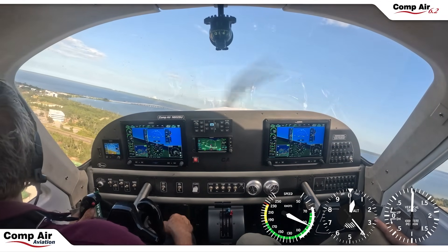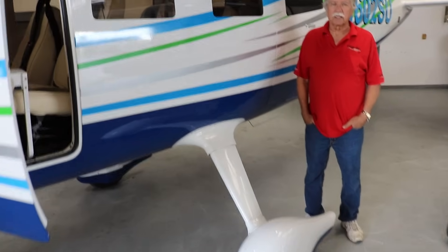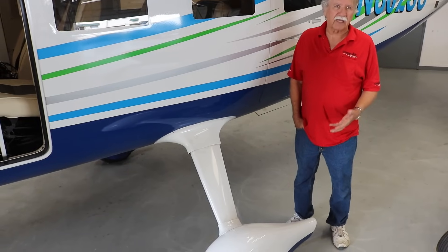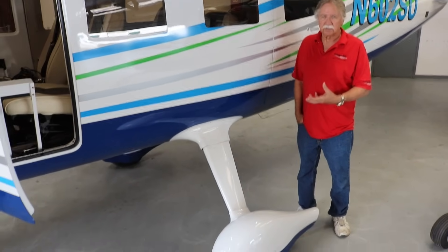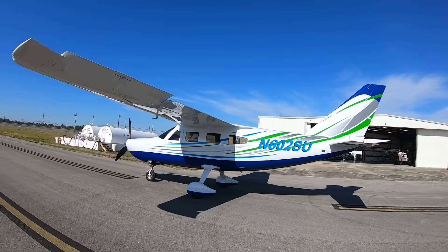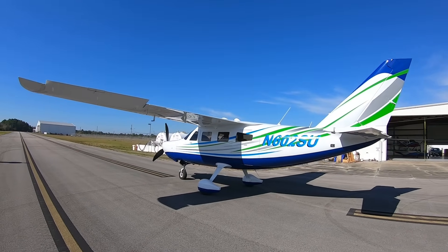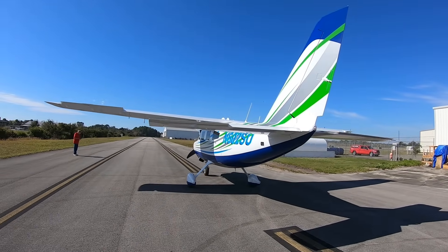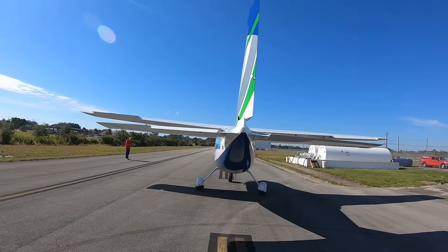What kind of surfaces can you handle? The airplane was designed with utility in mind, because most people only get to have one airplane. So if you're going to have one airplane, you want the best bang for your buck. It is a tricycle gear, and the landing gear is aluminum with 6.00-6 mains. We can accommodate larger tires — we can go with tundra tires or a 10-inch main. The idea is for multiple surfaces — yes, you can go into soft field and short field. Basically, if you can fly a Cessna 206 there, this airplane will go.